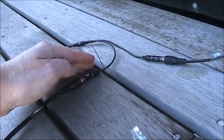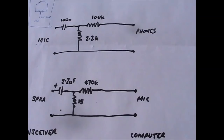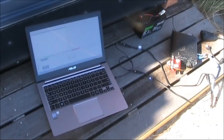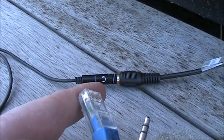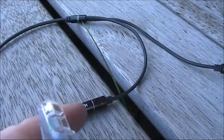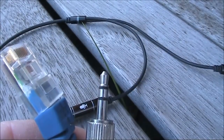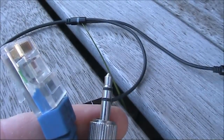Connecting into that Y cable is a cable that you can make yourself. The audio output from the computer goes into the FT-817's microphone connection, and the audio input to the computer comes from the speaker connection on the FT-817.